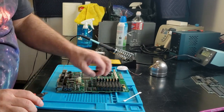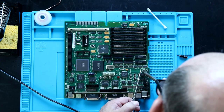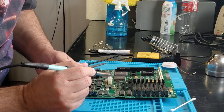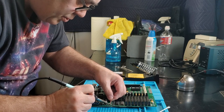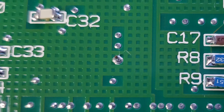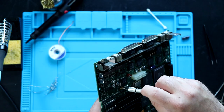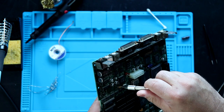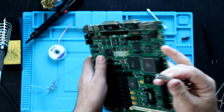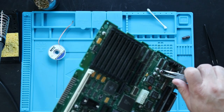You want to cut the lead so the part remaining on the board is fairly long. The leads came out easily by just applying some heat to the lead in the pad while gently pulling the lead through. Three of the four through holes cleaned up nicely, but the fourth was on a large ground plane and did not want to fully clear. I was wary of applying too much heat to this three-layer board, so I resorted to removing the last little bit of solder by drilling it out with a pin vise and a 0.8 millimeter drill bit.